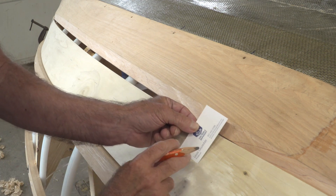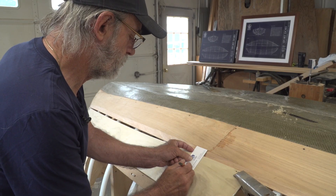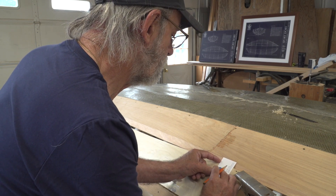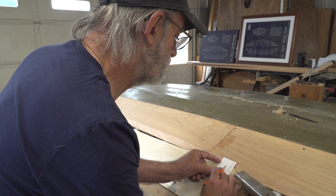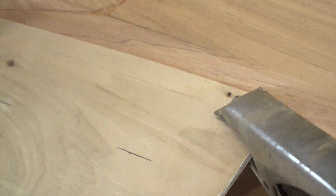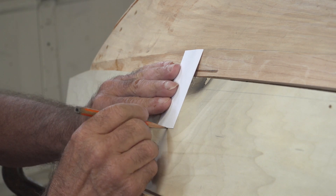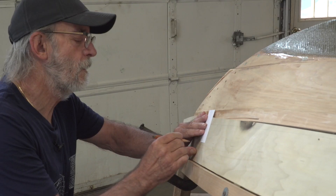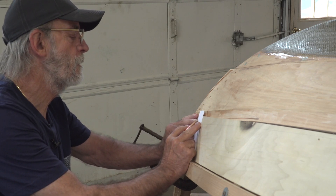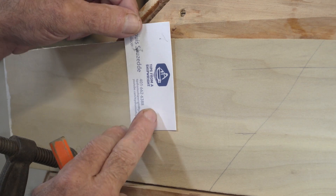When I transfer that onto the plank, all I have to do is set that business card down in the same spot and make a mark on the other end — that transfers the pattern onto the material. You can also do spiling with a pair of dividers, but I've never really liked that system — it leaves little holes in what you're working on and it's never as accurate. I've always used a block. I remember when I first started working on boats I had a little piece of plastic I carried everywhere and used for years. When I lost it I was so disappointed. I've gone over to using a business card and it works fantastic.